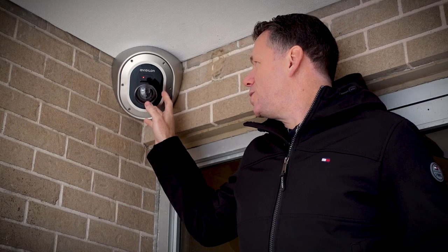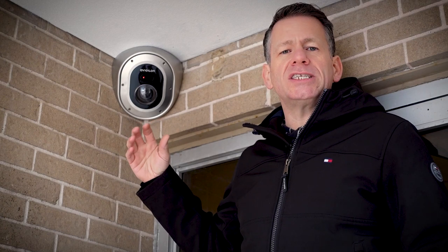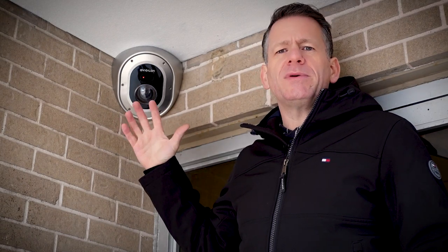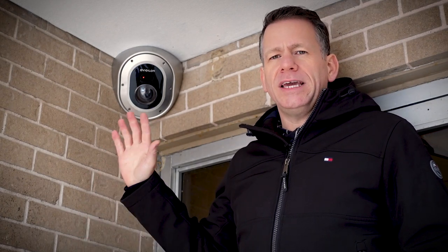This camera is extremely tough — like a little safe. It's heavy duty, stainless steel. The dome itself can handle an impact from a 25-pound sledgehammer. It's a wide-angle lens but still adjustable — it's a motorized lens that goes from 3mm to 9mm, giving you a very wide field of view. The camera also has a microphone built in, as well as infrared. The infrared uses an invisible wavelength, so it's not causing a distraction to someone trying to sleep.